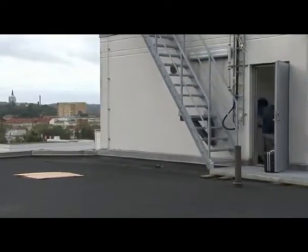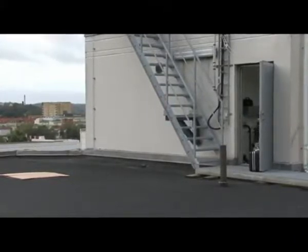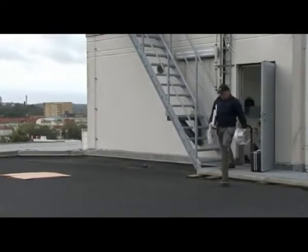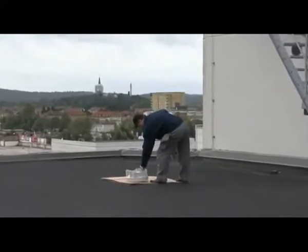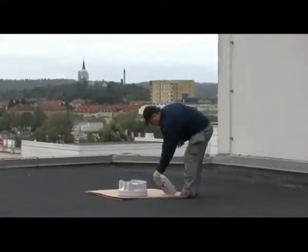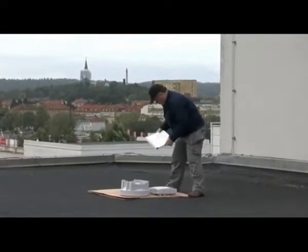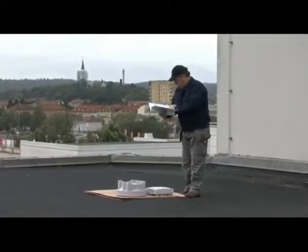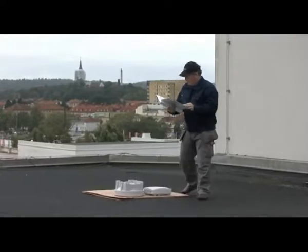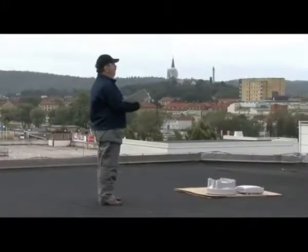Dump all your installation gear and carry in the star of the show, the Minilink radio unit and antenna. You will need to mechanically adjust these. Check the site installation documents drawn up by the engineering department. This you should inspect and compare with reality. Familiarise yourself with the proposed installation area, the mast, the cable routes.